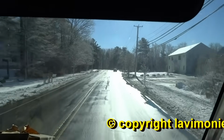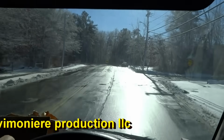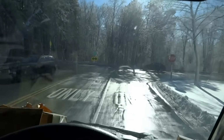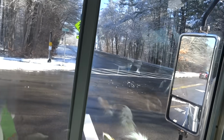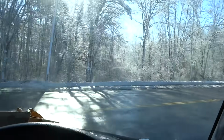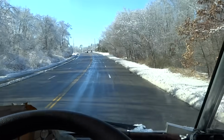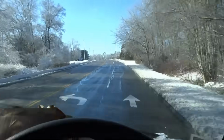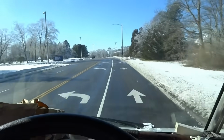So I got a call. I was over there a couple of months ago and I worked on this water heater. I cleaned the generator and it seemed to work for a couple of months, and the thing's out again. So I'm going to go over there and replace the generator this time. I told the guy it's not worth putting a new gas valve in that thing. If it's a gas valve, it's going to need a new water heater. It's an older water heater. So let's see if the generator will work.